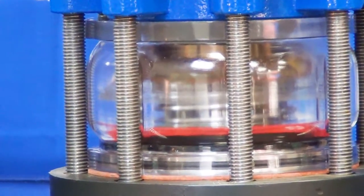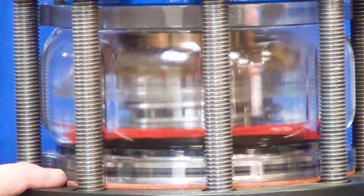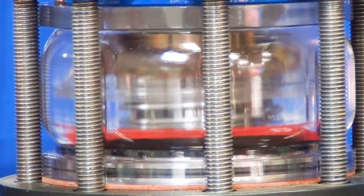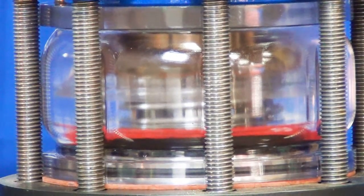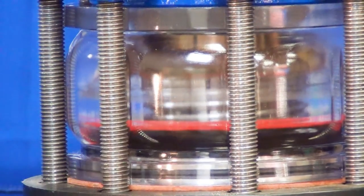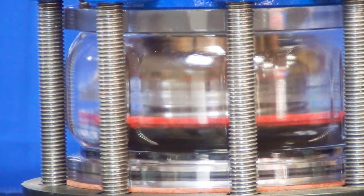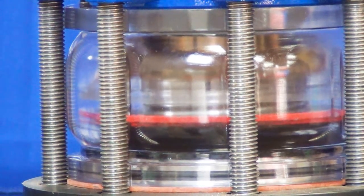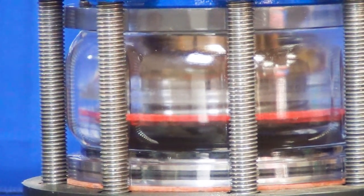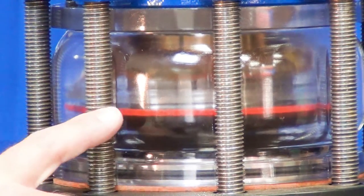What kind of flow rate do we have now? Right now we have 132 gallons per minute flowing through the 4-inch check valve. We're going to increase that — that's about 450 RPMs on the motor. We're going to slowly increase that and you're going to see the poppet slowly opening to its full travel. Even at lower flows, we're at 140 gallons a minute now, and that poppet is very stable in the flow. As we increase the flow, we'll see the valve go full open up against its upper stop.